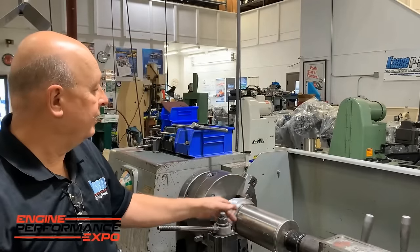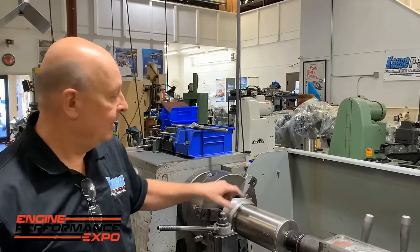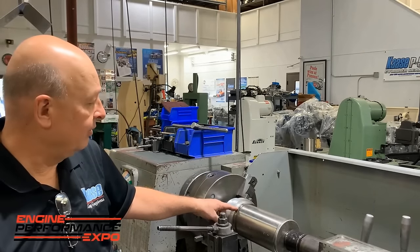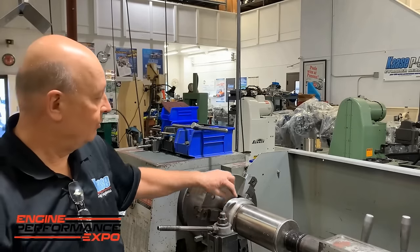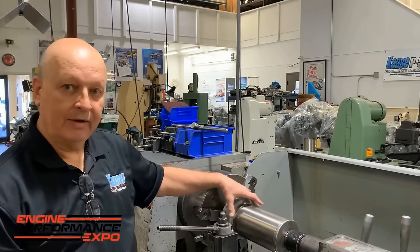And we can make our cut. If we have to do some work on the flange, we might flip it around. But we've made hundreds of sleeves this way. We're driving them just by that little taper. It'll stay around. It won't expand it really.